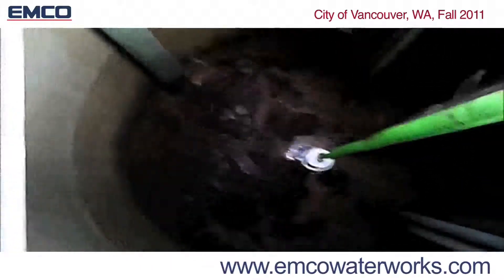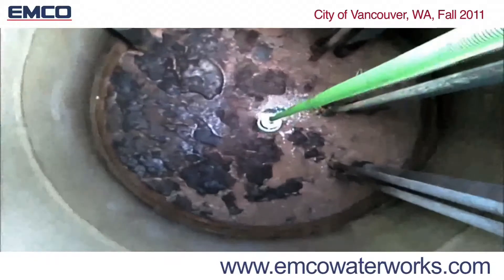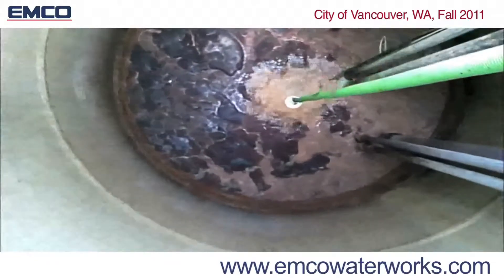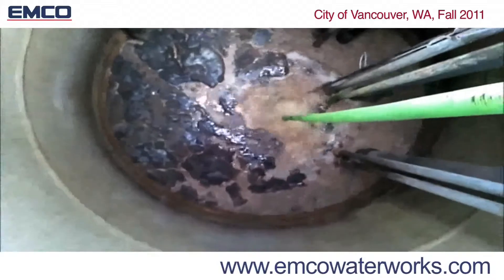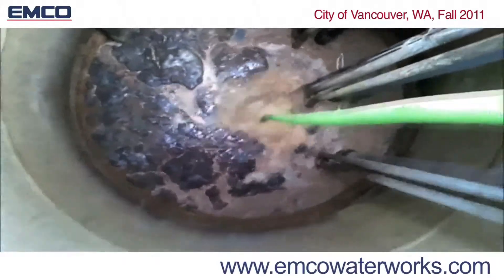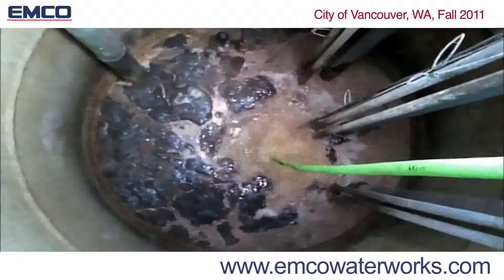The air is diffused through a special Venturi air manifold which has no moving parts and is maintenance free. A combination of fine and coarse air bubbles are released in a confined space inside the digester, creating a violent tornado effect and bubble speeds of 60 feet per second that very effectively transfers oxygen into the water column, raising dissolved oxygen levels with little energy consumed.